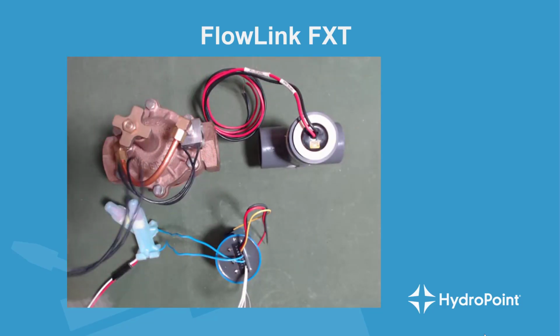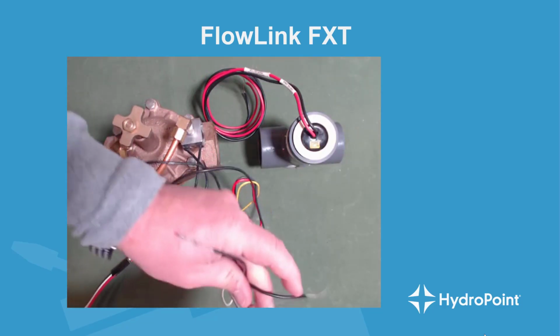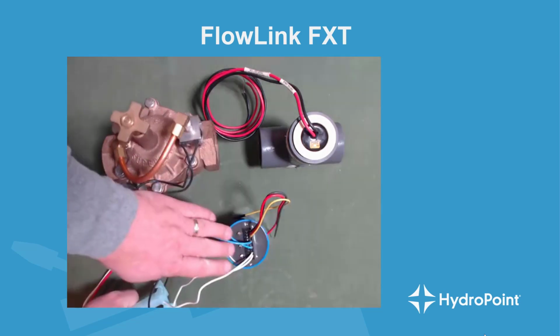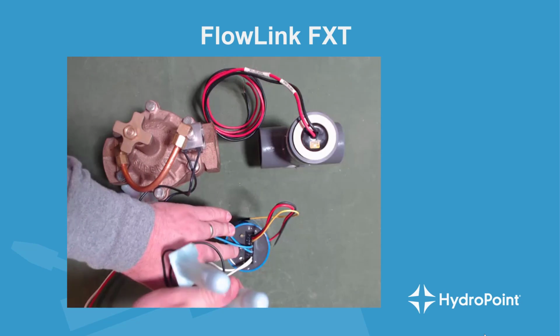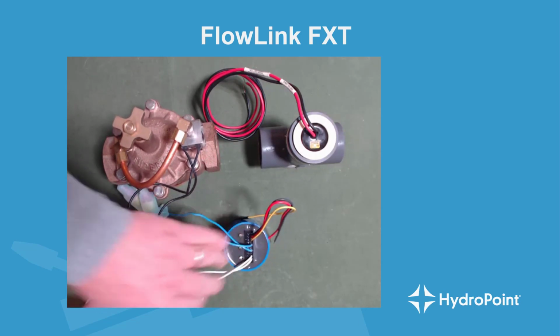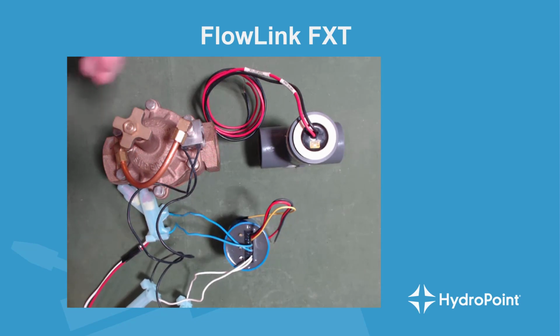Once I've got my power wires hooked up, I take the two white wires from the FXT and hook them to the two wires for the master valve. Again, using my DBRY wire connectors to seal out any water or other contaminants. And then I'm ready to wire up my flow sensor.